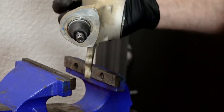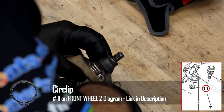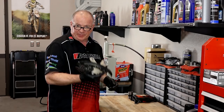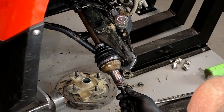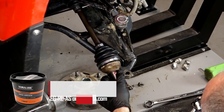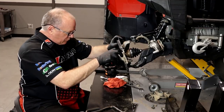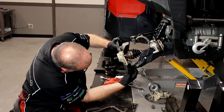Believe it or not guys, that's it. Let's get that circlip put back on there — circlip in, then that plastic cover. Let's get it put back on the machine. Should we ever have to take this back apart again, go ahead and take just a little bit of grease to the splines so it doesn't rust and it'll come apart easily. Get that slid back through, get our lower one on, get it started.